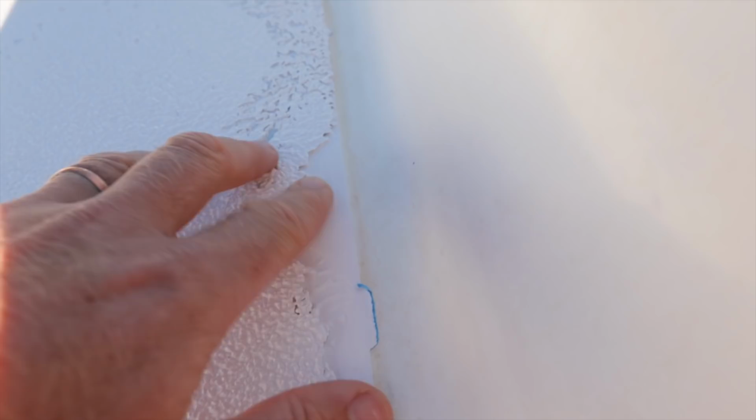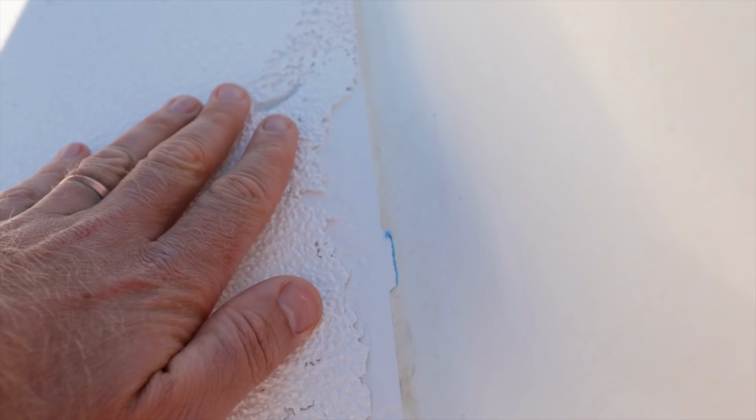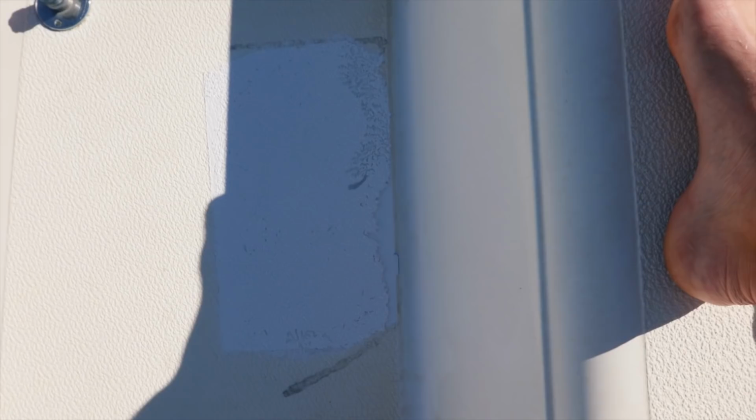So things didn't quite go as I planned here. The mold I made worked, but I really should have used some sandbags or some bags of water to clamp this down. So you can see along here, I didn't get the mold pressed down very nicely. The gel coat just didn't squeeze enough out to cover this. The cool part though is that now that I have the mold and I know what I'm doing, I can take another crack at it. Meanwhile, it's watertight. But we're learning.